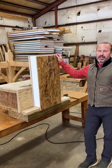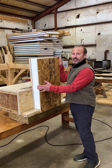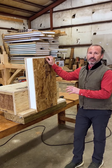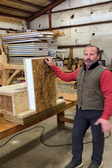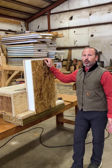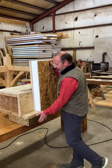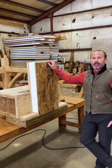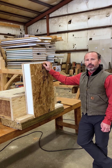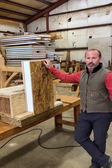So this is our typical detail. We like to use it because it employs the strength of the SIP that we're already using to enclose the building, so when it works as the hold down, we like to use it. Stay tuned for a few more videos that show you some mechanical hold downs you might need if you don't have a first floor platform or a concrete wall to attach to — we'll go through several different commercially available metal fasteners that help you attach a timber frame down to whatever your foundation is.